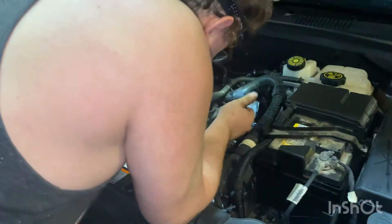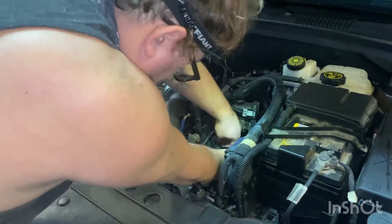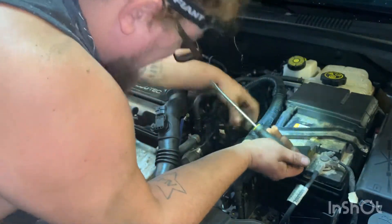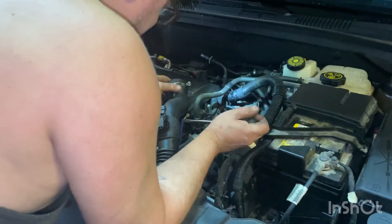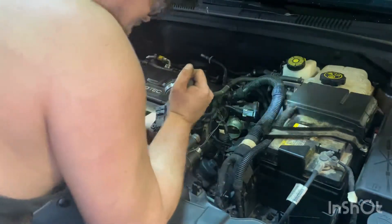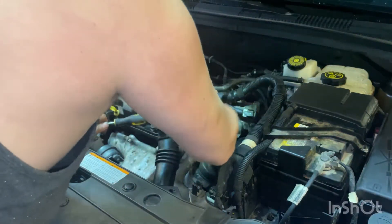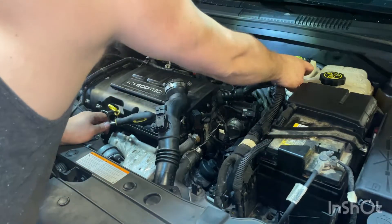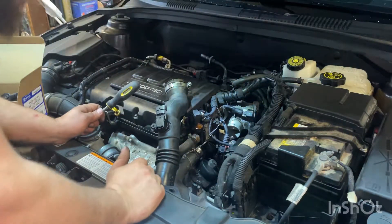There's a little sensor here that's kind of in the way — we got a little sensor down here that goes to our new water outlet. We'll pull that off right now. They wire-tied this hose so it stays up in there — whatever works to get it over here without paying for a tow, right. Pop this clip out, it just comes right out. That clip is going to take our upper hose off right there, and we're just going to shove that back out of the way.